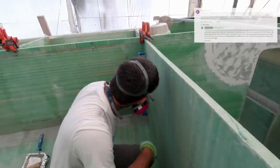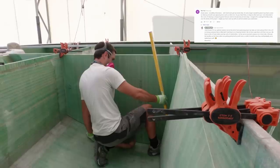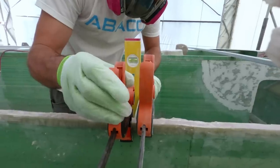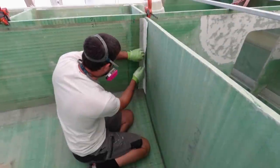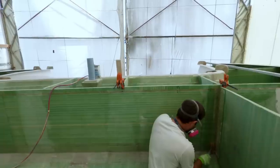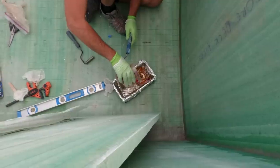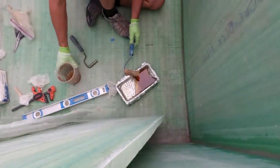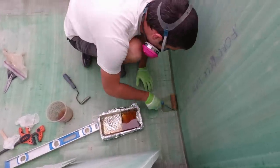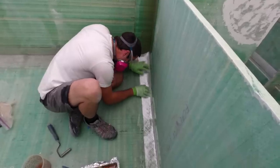Last week, Neil asked: it would be great if you had a scene with what you do with your glassing tools - do you clean them or dispose after each use? Except for the tongue depressors which we use to mix the resin, most of our tools get reused every single time we do this. In our quiver, we have two mini rollers and two metal rollers, which at the end of each use get placed into a 32-ounce container filled with Total Boat's Eco-Solvent. They sit there until ready for their next use, and so far it's done a great job. We have had to add two new metal rollers to our collection since we began six months ago, but that's usually our own fault for leaving it out too long to the point where the resin begins to cure between the blades.